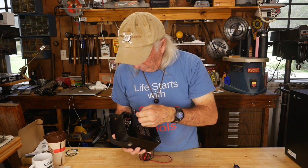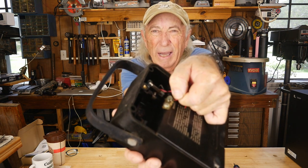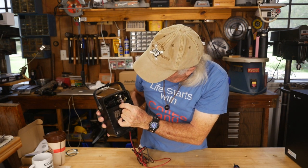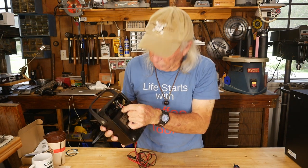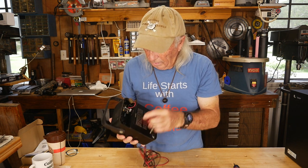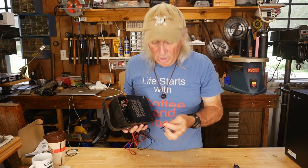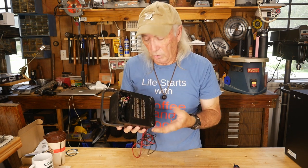There are the old 9-volt battery terminals — pretty disgusting, but expected from old tools. The battery containment area for the 9-volt also has a lot of acid to clean out — hydrogen peroxide and a little Q-tip to get in there. Then at some point I'll take some light emery cloth and touch up the tabs to make sure I get a good battery connection. The meter is totally usable — what's down below is the control package side, and later we'll probably open that up and clean it as well.